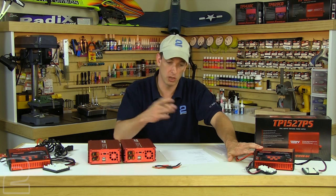Once you jump into higher cell counts, you'll need to switch over to 27 volts. Keep in mind, if your charger can handle higher voltages — like the TP820CD, whose acceptable input range is as low as 10.5 volts all the way up to 28 volts DC — you'll want to take advantage of that.